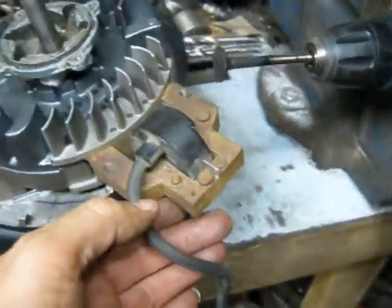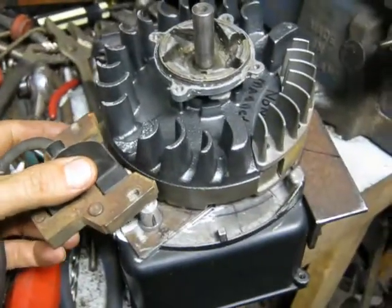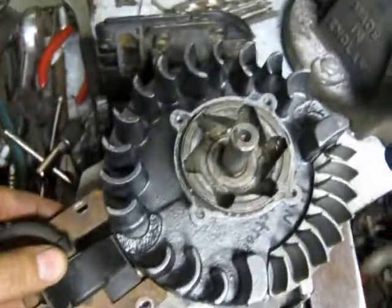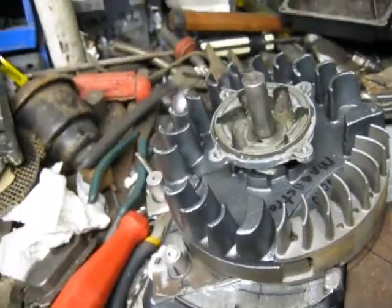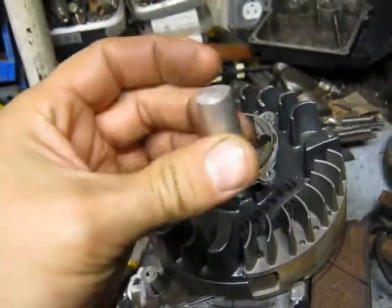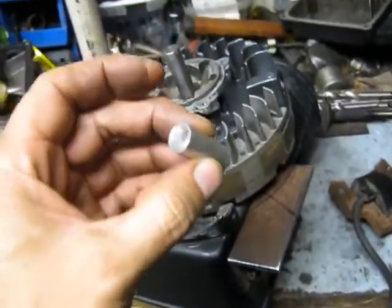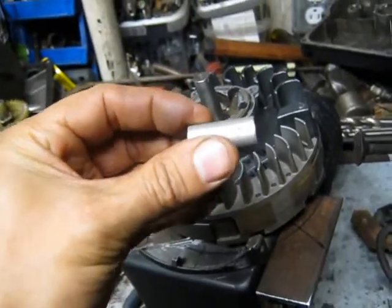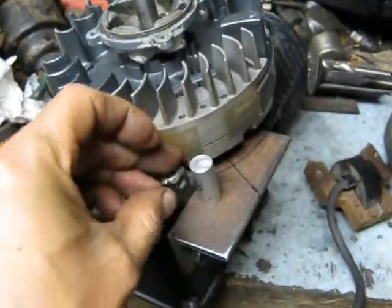Making the mounts here — got this one already made, so this magneto will bolt on there like that. I'm machining — well, making — the other ones. I have a half-inch aluminum dowel, cut it to length on the chop saw, but the ends weren't square, and when you have two of these on there you need them to be square.